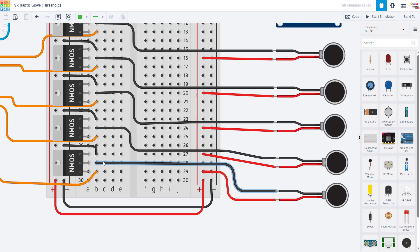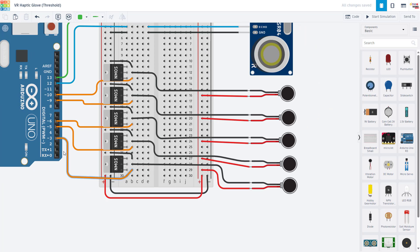I have the drain pin of the MOSFET connected to the negative wire of the motor. On the physical circuit, this is a separate wire that is soldered and heat-shrunk to the smaller, more fragile motor wire. The positive wire from the motor then goes to the positive bus on the breadboard to connect to 5 volts. So how this works: when the corresponding Arduino pin is low, the MOSFET is off and no current flows through the motor. When pin 3 goes high, the MOSFET turns on — think of it like a valve or faucet that lets electrical current flow. The current that powers the motor flows from the positive bus through the motor, out through the negative wire, into the drain pin, through the MOSFET, and out the source to ground. The gate control pin is not actually drawing any current, so these lower-power Arduino pins don't have to provide power for the motor.